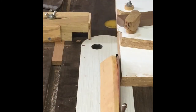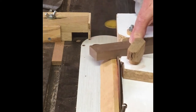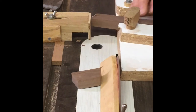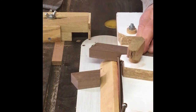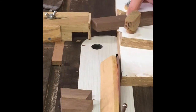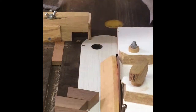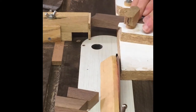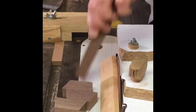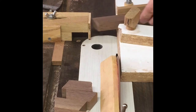This bowl had several walled rings, and I used the wedgie sled for the segments and cut the segments from the ring. The width of the segment was determined by the design plan. Keep in mind these angles have to be quite precise so you don't end up with gaps.